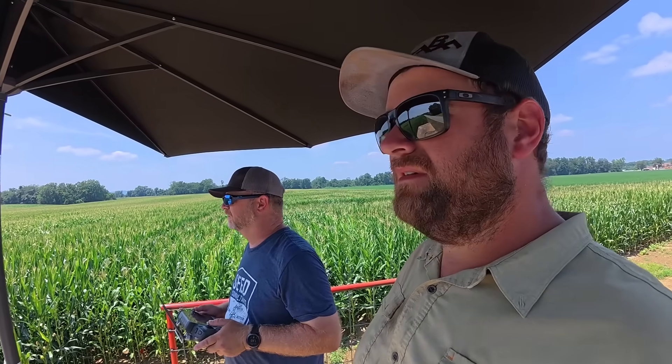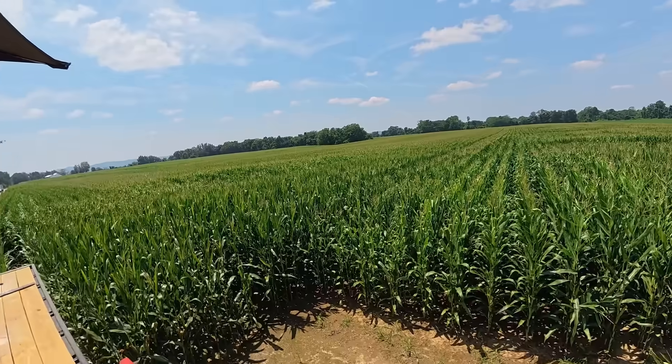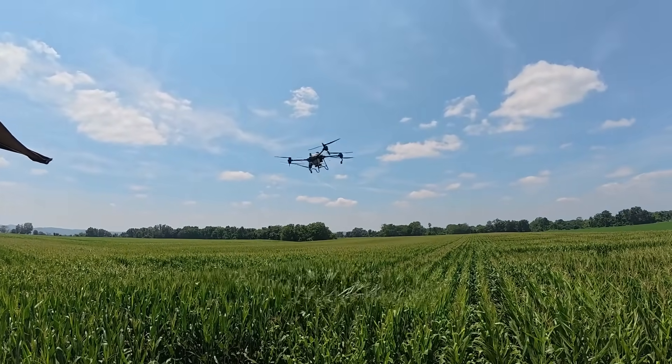The main drawback of the drone compared to a sprayer is capacity. We're putting on two gallons per acre with a 10-gallon tank, so that's five acres at a time — a lot of fill-ups. But the fill-ups are quick, so it's not as big of an issue as you'd think once you get grooving. This trailer probably doubled our productivity compared to doing it on the ground. We have right at 1,400 acres of corn this year, and if he can do 200 acres a day easily, we can get through our needs no problem. That's a DJI T40.